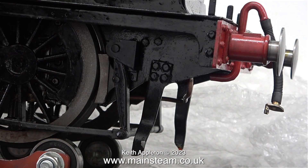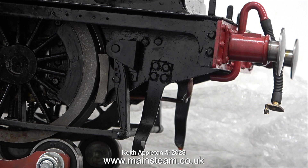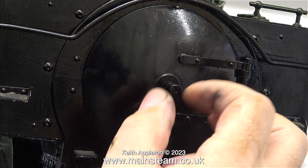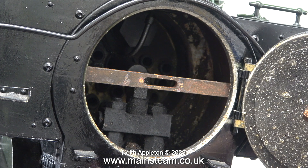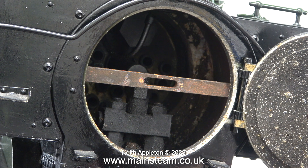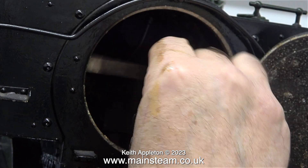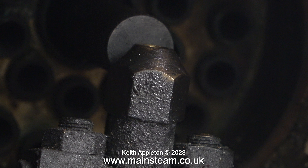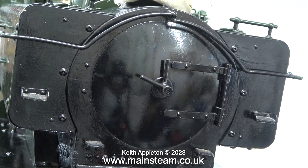Once it was found that the oil pump worked perfectly I connected the end of this oil pipe to the check valve on the steam chest. I'm opening the smoke box door so you can see what's going on inside the smoke box. First of all I remove the crossbar from inside the door. With the crossbar out of the way, if you look carefully at the blast pipe you can see traces of oil around the top of it. This close-up shot shows the oil around the top of the blast pipe. When running miniature steam locomotives it's always a good idea to keep your eye on the top of the chimney. The soot around the chimney should contain oil residue and be a very black colour. If it's light grey then there's a good chance you're not getting enough oil.